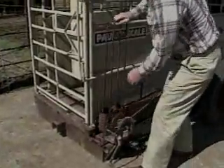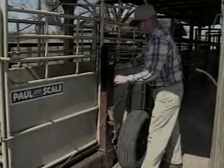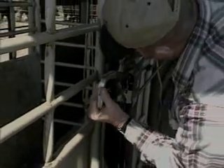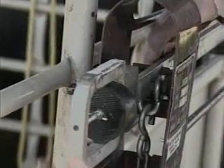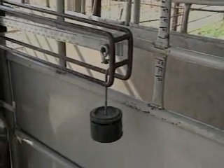Lift up the frame that holds the weigh beam. Insert the weigh beam from left to right of the frame and hook the cable from the base of the scales to the weigh beam. Make sure the knives of the V-shape section on the weigh beam fit in the grooves on the frame. Then hook the scale part that holds the extra weights to the weigh beam at the right end.